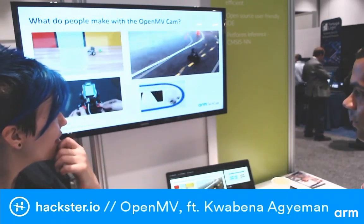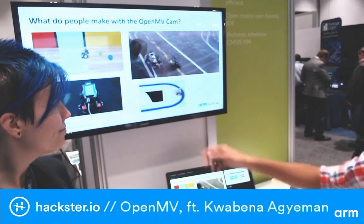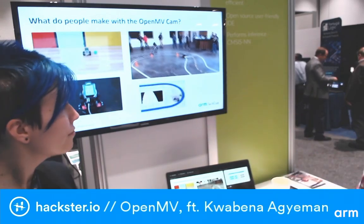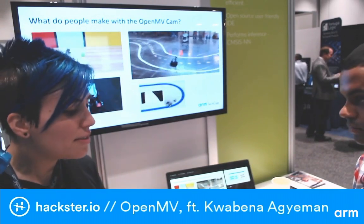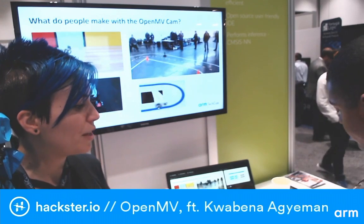Linear regression finds the yellow pixels in the image and draws a line through them, and the robot steers to stay on the line. That same thing is happening with this full robot — it's doing binary image segmentation and then linear regression to find the center of the line and travel along it. The USB connection is just for power; all the processing is happening on the camera itself.